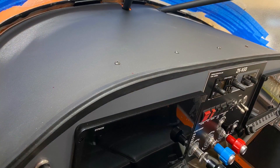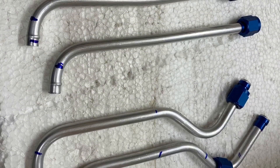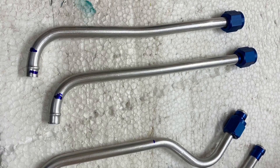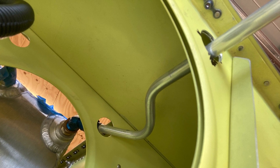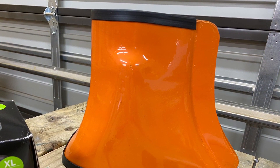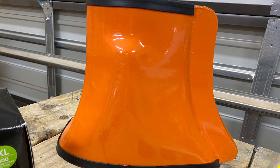In the week leading up to that there were quite a few small jobs done. Here's a cover I made up for the dash panel, and these are the fuel lines being prepared from the fuel tank through to the wing root — you can see some 90-degree bends in them, and here's why: they have to go through two different ribs at an angle. Earlier I was showing the strut fairings and here's another shot of that showing the rubber seals around them.